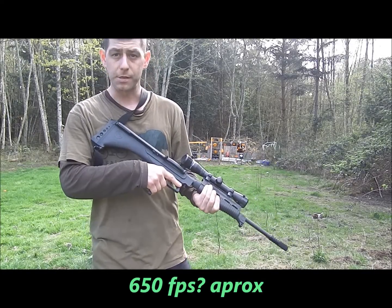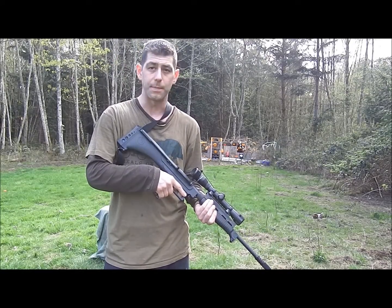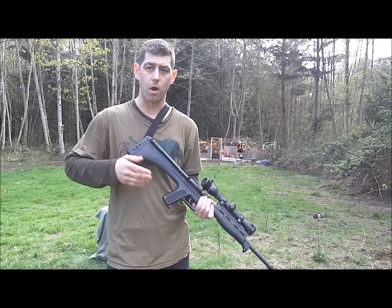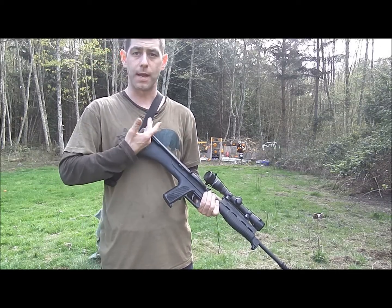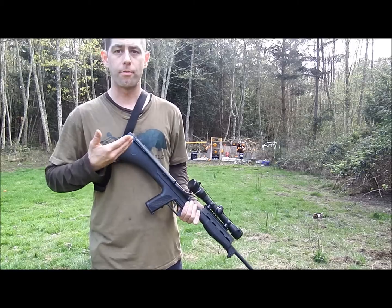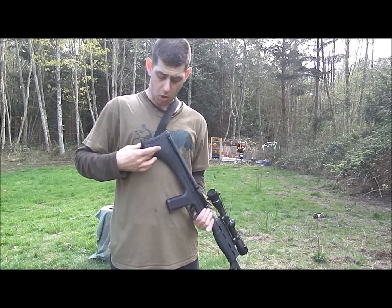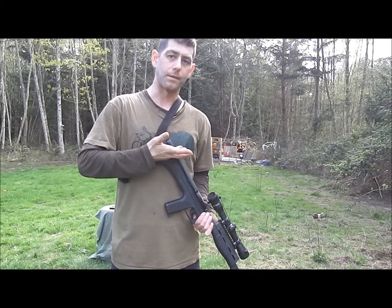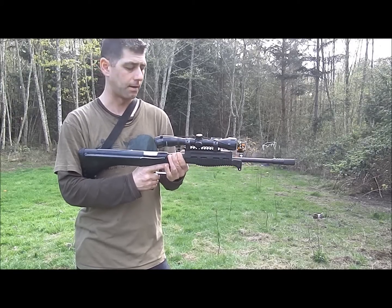yeah, when I bought it, it was basically a piece of crap, so I completely rebuilt everything that needed to be rebuilt. The hanger that holds the stock on broke off within the first shot, so I put a new long bolt in that was able to catch the actual rifle and pull it down onto the stock instead of threaded into that hanger, which had a shorter bolt. The longer one was able to thread into the exact hole that was on the gun itself, so I kind of lucked out that way. I didn't have to do any drilling or tapping.